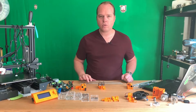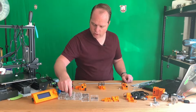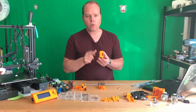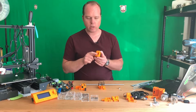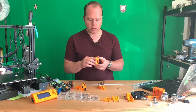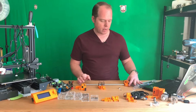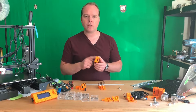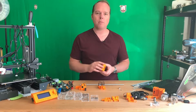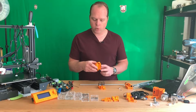And then we are going to strap everything in. So it's going to look like this. This one goes in there. Then we add this. When you are going to print this, make sure that you use small screws on the end. This is to make sure that the gantry can be adjusted just a little bit. There are some modifications for this one, like a belt tensioner for the X-axis, but I'm not going to use it in my 3D printer.